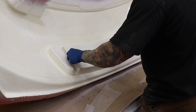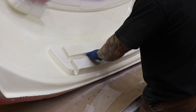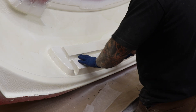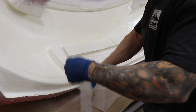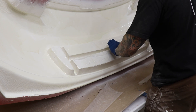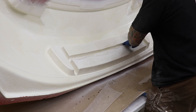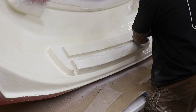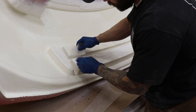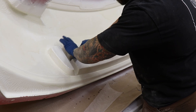This area here is a particular concern because of the type of crevice — it will become very resin heavy if you try to get a lot of fiberglass in here. So we're going to very carefully apply some of this fiberglass veil. This is not structurally sound, but what it will do is support the gel coat so that if there are any voids in my fiberglass chop strand mat, which there surely will be because this is such a complex curve, it will keep the gel coat strong. Obviously you want no voids at all, but I just have not been capable of applying it in a method that prevents any voids, so we're going to reinforce it as much as we can.